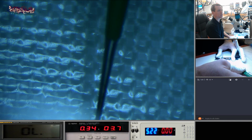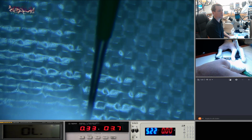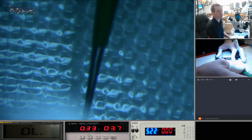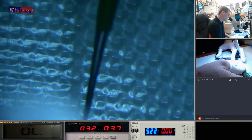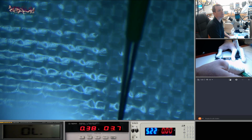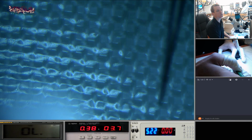So it'll probably dip in and out, but once that stabilises, that'll tell us that the phone's getting ready to boot on, so it's sending power. What it's doing now is booting up different rails on the phone, and it's checking to see whether those rails are fine. We've got a backlight and an Apple logo, so it's good. This here is the voltage. This one here is the amps.